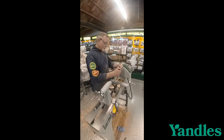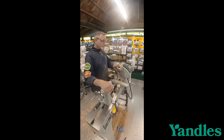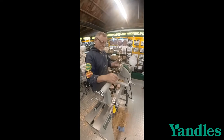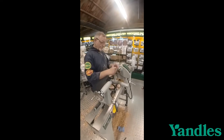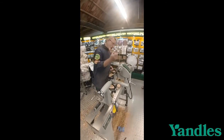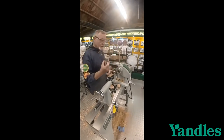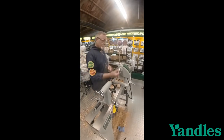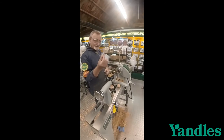This one I use when I'm reversing platters onto a disc with non-slip material on it, and it just sits against it, it rotates like mad, and just keeps it pressed in place quietly. The most useful live center you can get, but nobody else thinks to go and buy some nuts and make all their own ends.